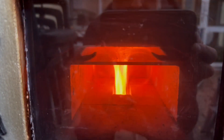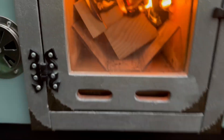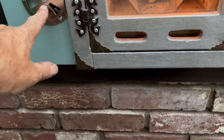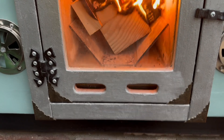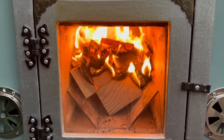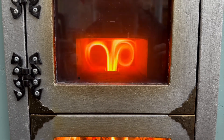We're now exactly 12 minutes since I lit the fire and most of the soot is burnt off. The fire is running pretty well with all vents open. What I'm going to do is stuff a rag in the bottom vents and see what happens — see how well the stove behaves with that restriction.